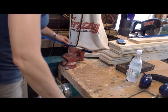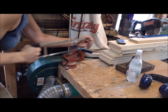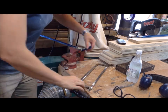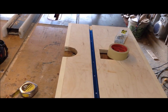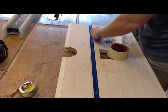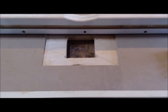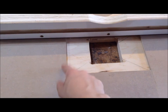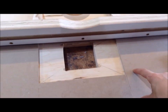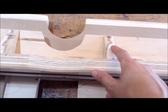It's pretty easy to hacksaw through — my hacksaw is missing a bunch of teeth, which is why it's taking forever. I added all the T-track to the bottom; it ended up being three pieces: two short ends and one long piece in the middle. I attached it with 3/4-inch wood screws. On thinner jigs you might need half-inch screws. In the book example, the T-track on the tabletop enables you to move the fence back and forth and also put hold-downs in the front.